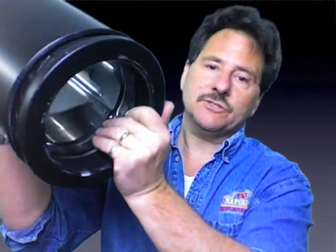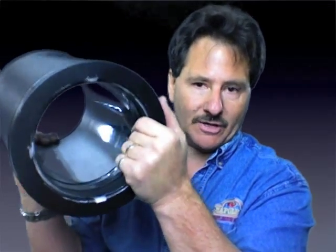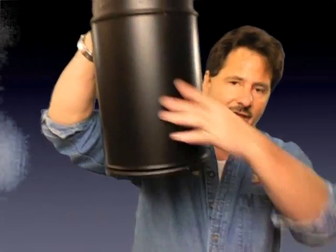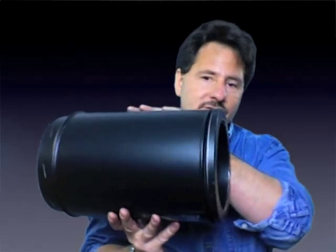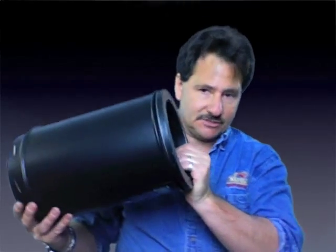This simply attaches right to the bottom here — we just put it on there, nice tight fit — and this basically gives you a bottom trim piece and an adapter which helps you handle the pipe going into it. You've got pipe coming down from the ceiling and you've got to figure out how to put your single wall into this adequately. Whether it's clamped with a roof support hanging down, or coming horizontal through the wall from a horizontal system, it's going to need the same thing.